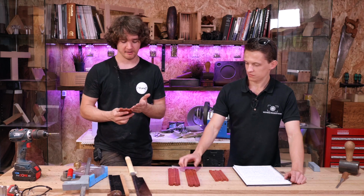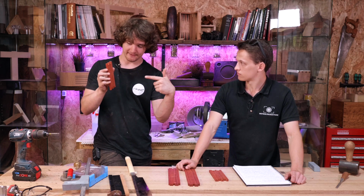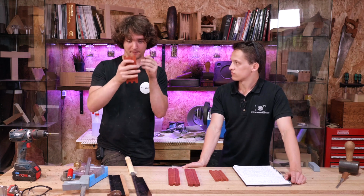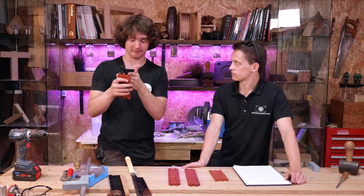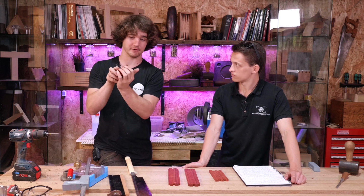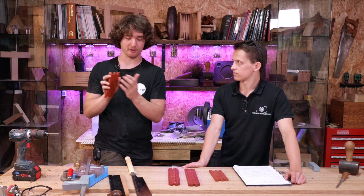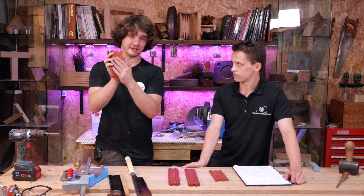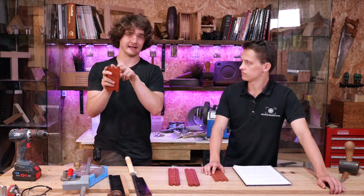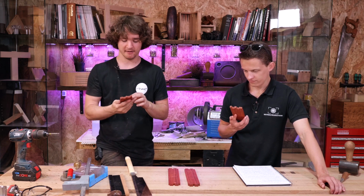And the other thing is, you made a conscious effort when you cut these out that you were looking at the exposed face. Exactly. Whereas if you were to look at this from the back edge, you'd get that back line completely straight, which is a bit pointless really, because it's going to be hidden once the tails are assembled, and then you'd have some undercut or overcut on the front of the pins. So always make sure you're looking at the component from the front when you're cutting it out, and then if something happens on the back, it doesn't matter, it's all hidden. You'll see that in the next video anyway.